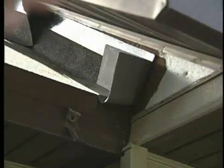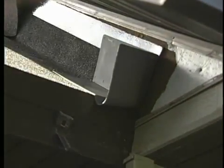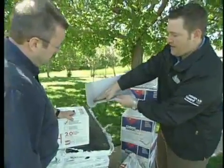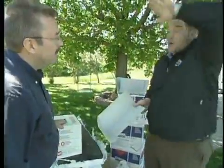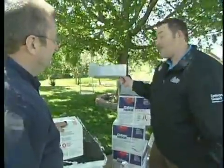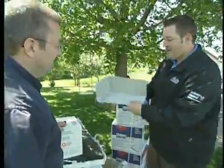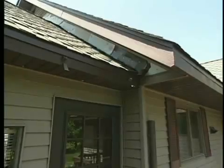That's what we're talking about on today's show. That's two out of five in the Weather Watch system — what's the next step? Well, there are a lot of different flashings that go into a house. Where a roof meets the actual siding, you want water coming down to hit what we call our kick-out flashing, which kicks it away from the house. When those roofs come into the house, that's almost always where you see rot. I was on one house where it cost $7,000 more because somebody didn't install a $6 part. Seven grand for six bucks — it's not required by code, but it's required by us. The attention to detail is what separates roofers.